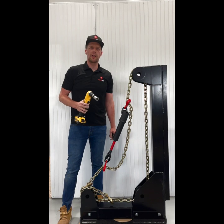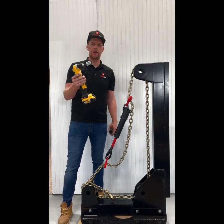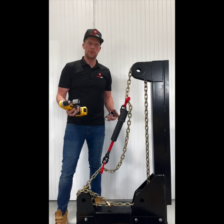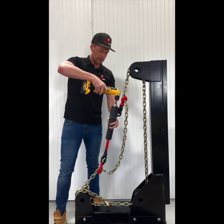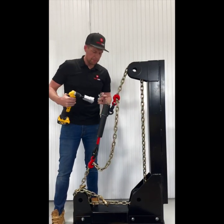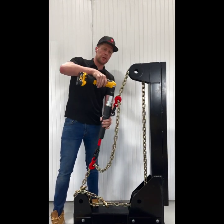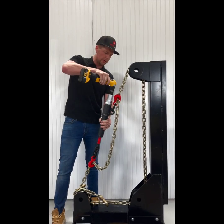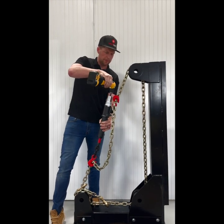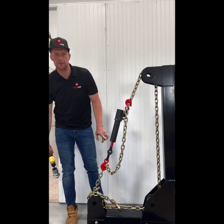If you're running six or more Reviloc units on one load, one way to be more efficient and fast: leave off the amplifier and just put the socket on the battery drill. Make sure you're in setting number two and go around each unit and draw them tight. Once they're tight, pop off the socket, put the amplifier back on, make sure the drill is in setting number one, and then clutch out each unit on the load. Once you've hit the clutch, you're good to go — just make sure that the red loading zone is visible on the hex rod.